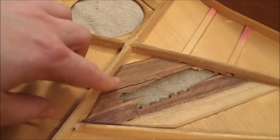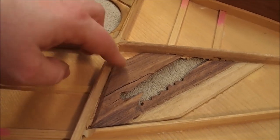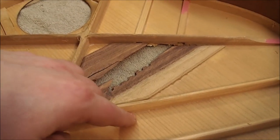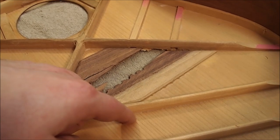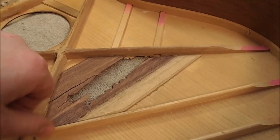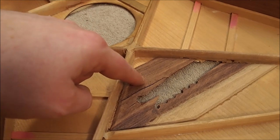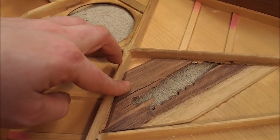The bridge pad is the oversized design of the period - it appears to be a solid Central American wood, one of the fake rosewoods. The glue they used is extremely tenacious. It looks like standard white glue but getting that back off was really tough - stronger than any white glue I've encountered before. That makes me wonder how easy it's going to be to get off that bridge pad. I might end up having to carve it off.